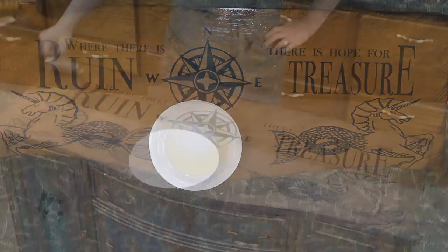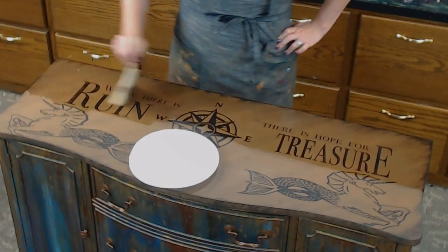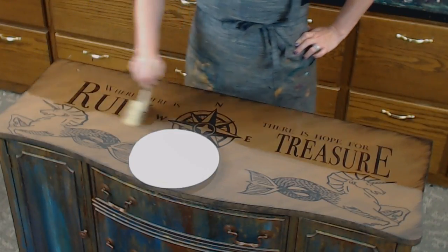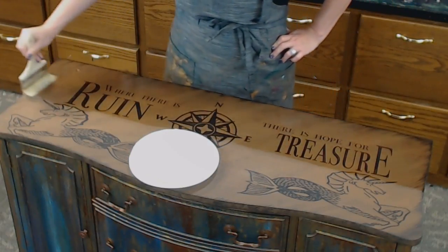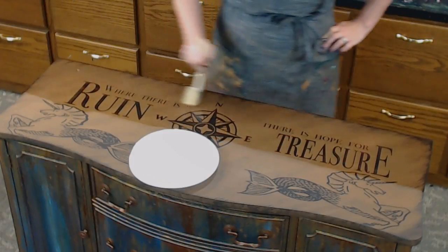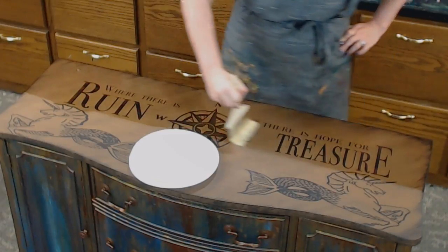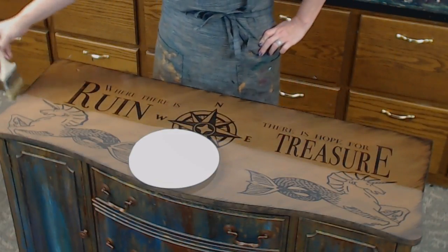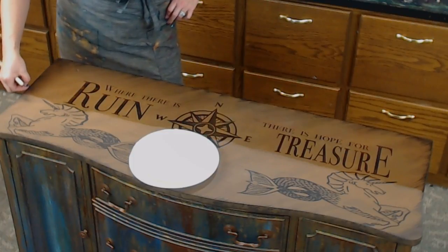So it's hard, I think it must be, because this has to be the going thing for many, many years, is that oil-based sealers yellow. The only one that I have had not yellow is glaze coat. But again, that's keeping it out of direct sunlight because glaze coat has no SPF in it. So you need to keep that in mind as well.